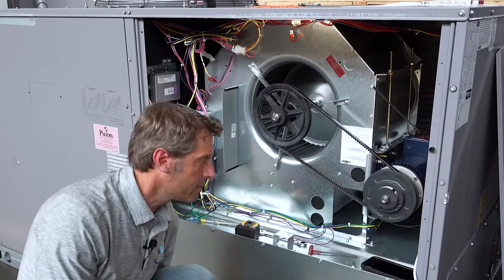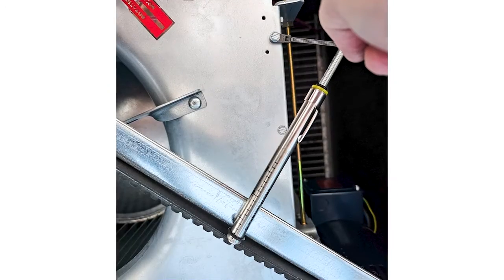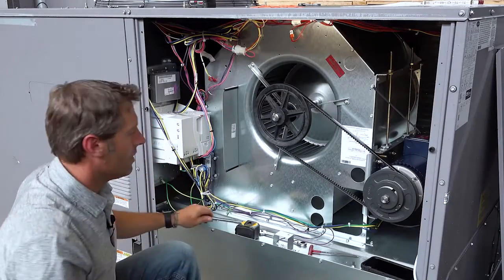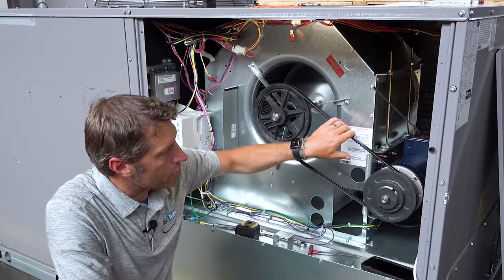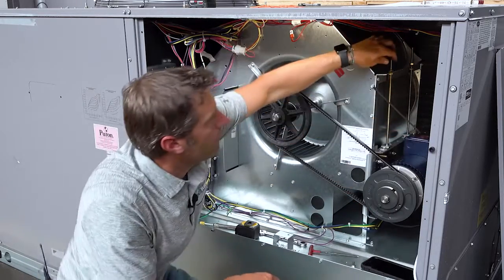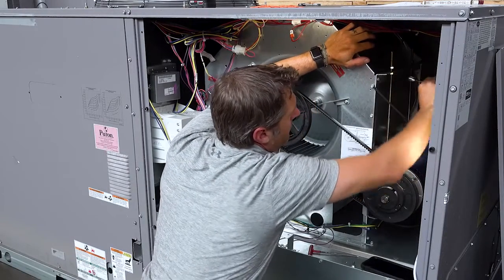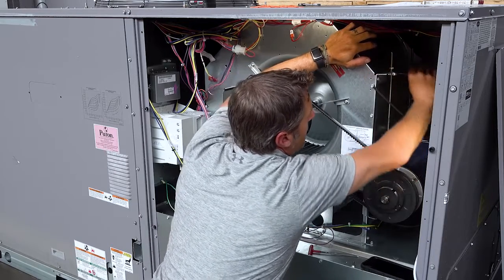How do we know if we've got too tight a belt? When we did the deflection test, the deflector was not getting past our point of deflection — the belt is too tight. We've got the pounds of force up top but the belt is not deflecting properly. So we have to raise the motor up to make the span shorter, which will loosen the belt. To do that we've got four bolts on our motor plate — two in front, two in back — and four nuts on top of the lifting rods on the motor. We'll also recheck our deflection.